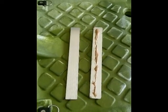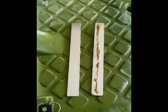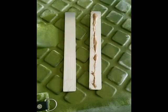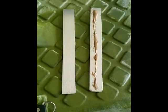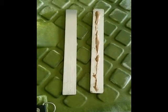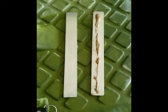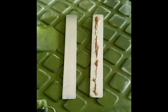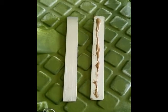We've obtained a one metre strip of aluminium from Bunnings. We've cut two 270mm pieces and we've just applied a bead of liquid nails to one surface. We're going to use the instant contact method where we will push this down onto the hull, remove it, let it partially dry for about five minutes and then fix it back firmly in place.